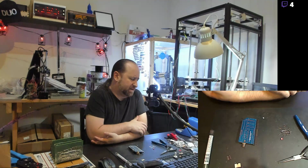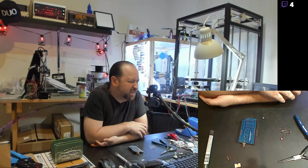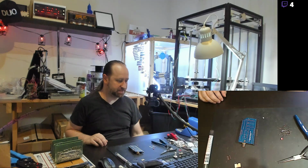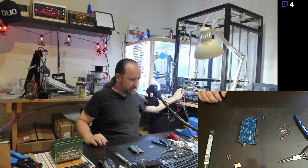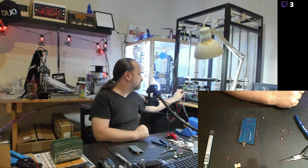And since I built it myself, it's probably around $1,000 in parts. Yeah, it's about $1,000 in parts. And quite honestly, that kind of build for $1,000 is fantastic. One of the most expensive parts is this control board. The Duet Wi-Fi control board is like $170 US. That's quite a lot of money. However, these things have really nice Trinamic 2660 drivers on them, and they print really well.